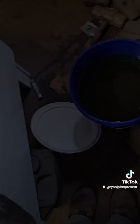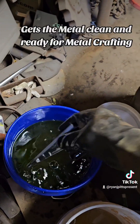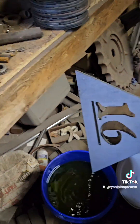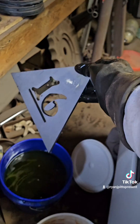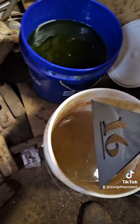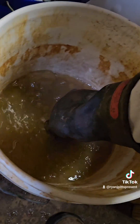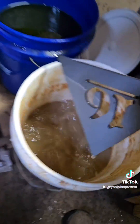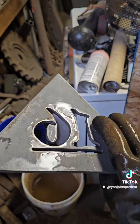Grabbing the d20 number 16 out of the muriatic acid. It does a beautiful job taking off any of the factory scale or rust. Then you put it into a water and baking soda solution, which neutralizes it, giving you some fresh clean metal to work with.